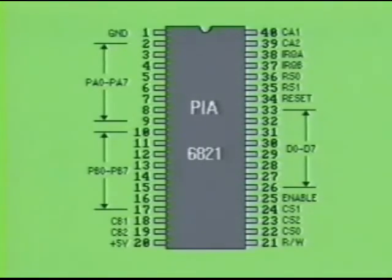The MC6821 is a typical input-output chip designed by Motorola to operate with the 6800 family of MPUs. This IC may be found operating with the 6800 8-bit computer or with the 68000 16-bit computer. The 6821 is a peripheral interface adapter, or PIA for short, which is constructed using NMOS technology.